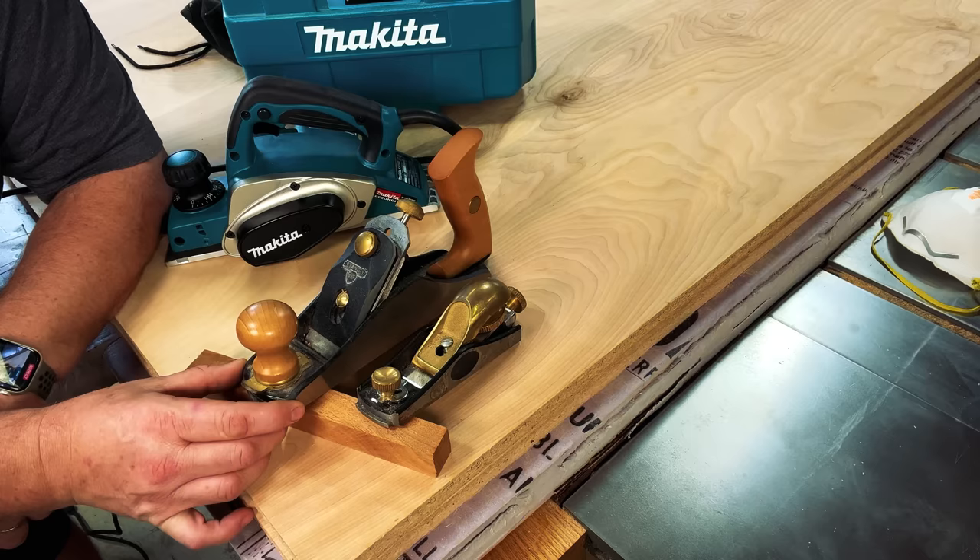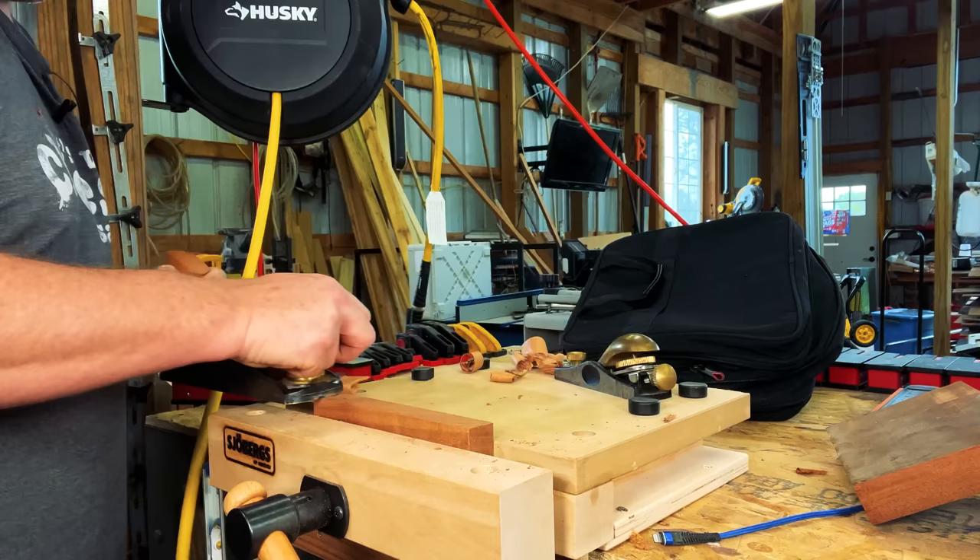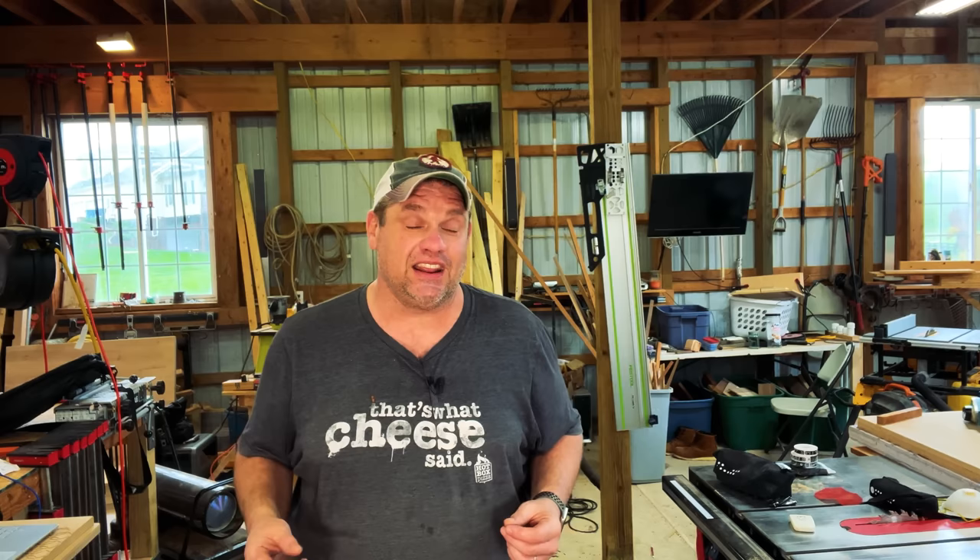Let me show you what I think is a better option. In my shop I have two hand planes I usually use: a Bench Dogs block plane and a Stanley Sweetheart number four. These planes give you the feel and allow you to remove just a tad with each pass. I'll take my Stanley number four, make two passes, and you'll see the difference in the shavings. A hand plane gives you a lot more control. I mostly use a plane for small cleanup near the end of a project. I'm sure those power planers have excellent uses, but in my shop this thing is just collecting dust.